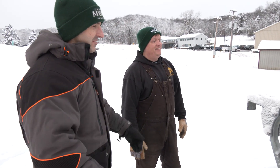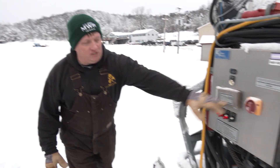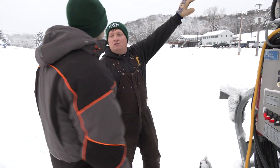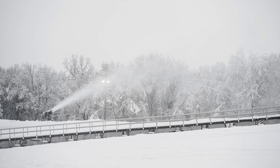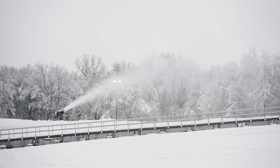I'm ready to make some snow. How does this thing work? So your controls on here — you have a compressor and the compressor builds up air pressure to push the water out of the gun. As the water is coming out of the gun, it starts at the nucleus, and that's what starts the snow making process. Then there's teeth around the outside that mist water to it and make the snow pellets — not really snowflakes. It's more like sugar out of a sugar bag when you're making really good snow. So first thing we can go over and we'll turn the compressor on.